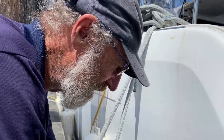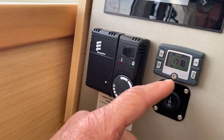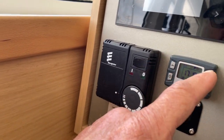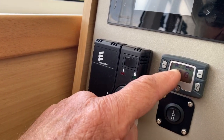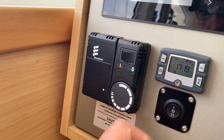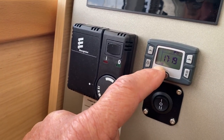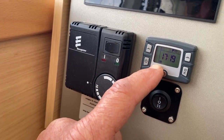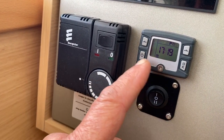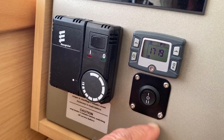But be patient, that's what you'll hear, and keep stuff out of the way. This is the little controller for the heat, and you can move the emblem across to the left or to the right just by engaging those. And if you look carefully, you can see a pulsing symbol designating a flame or heat. What you do is you press OK when that happens, and it'll transfer down to here. Can you see the same emblem there? And with that on, steady at the bottom like that, it will give you heat. And there is a timer for setting the amount of time that you want. We've preset this at half an hour, which we feel is adequate to heat up the boat.